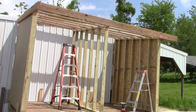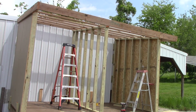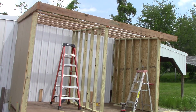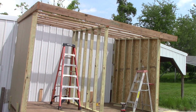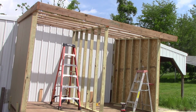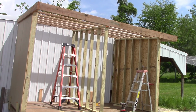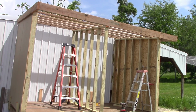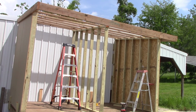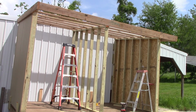But anyway, I'll have an electrical outlet near the sink to the outside here, away from the shower. And then we're going to put vents in up at the top on the sides, and the fronts are going to be vented to keep some decent air circulation. And I might look into some water resistant ceiling fans, moist environment ceiling fans, to put in them just to try and keep it fairly dry. Basically, when you walk in, turn on the light switch, the fan's going to come on. There'll be no way around it, and that'll help it keep dry in there.